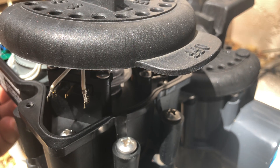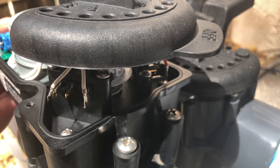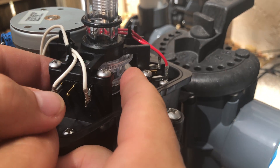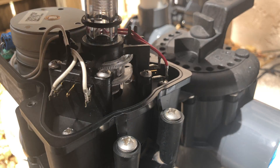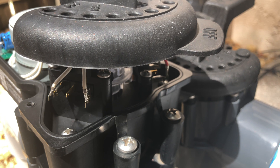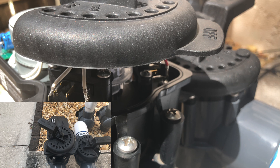If you want to stop at 45 degrees — for whatever reason, if you've got something where you're not wanting to close the line completely off — you do the same thing. Just turn this wheel around; you just twist it with your hands, it's not anything you can damage, you don't need a special tool, until it depresses. Now it'll stop right at 45 degrees, just like we want. You just time both wheels until you get the valve to do exactly what you want — it's as simple as that.